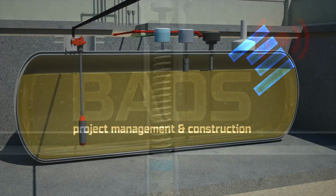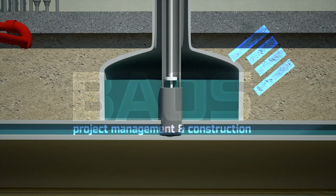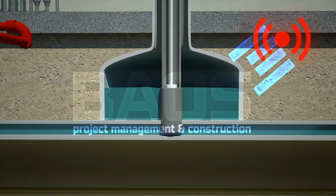The leak detection system detects and indicates leaks in double-walled tanks. The pump in the leak detector creates a fixed operational overpressure in the interstitial space. In case of a leak, the compressed air will escape through the leak. This prevents product or groundwater entering the interstitial space. Leaks in one of the walls will be detected and indicated by an optical and audible alarm before any stored product can pollute the environment.